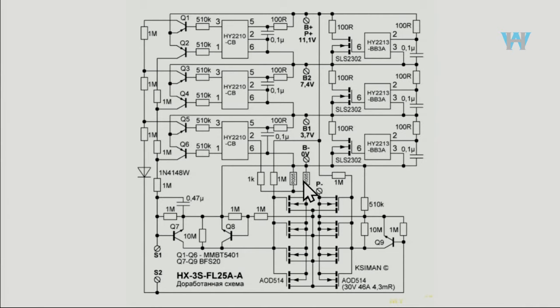As a result, this controls the gate of these four MOSFETs and shuts them down until the current drops below the threshold. When over-voltage protection triggers — if the input voltage or battery voltage increases beyond the set level — it controls these four MOSFETs via this transistor; they are turned off so current cannot flow through the negative terminal to charge the battery.